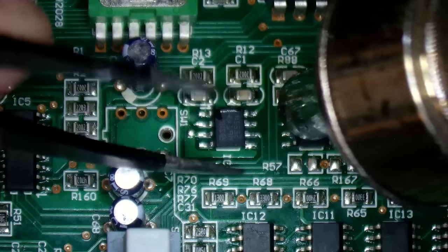Let's measure the resistance of them in circuit to see what they measure. 3.4k in that one, about this one, 3.1. To be fair, I can't actually see what they're supposed to be. Damn, getting old. They're both 10 kilo ohms, so, you know, it's not bad. But I want to check the output. So from ground, measure resistance to there. And we got 940 ohms. Okay. Here. Oh god, dead short.